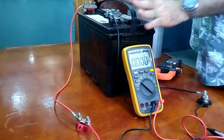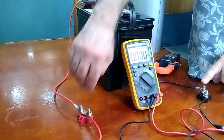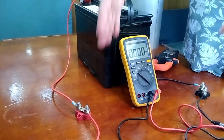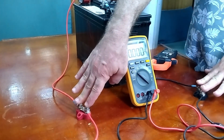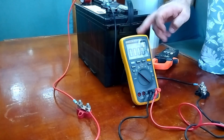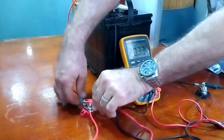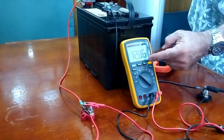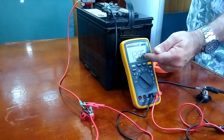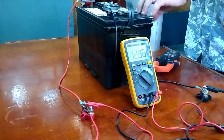So we have our battery, our house battery, and we have it connected to the bus. This bus — positive and negative — would be where your circuit panels are connected, all your circuit breakers, all your loads, and eventually all your charge sources. This is kind of the heart of the electrical part of the boat system. It's nice to have instrumentation so you can tell what's going on, so we're going to hook up a voltmeter here, set for DC volts, and clip it on to the bus. The bus is at 12.86 volts. This battery is fully charged — it was taken off charge just fairly recently. Usually it's 12.80 or just a little bit below, but it was recently charged so that's why it's just a tad above.